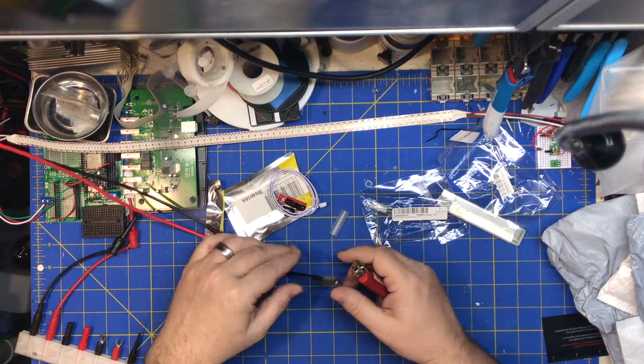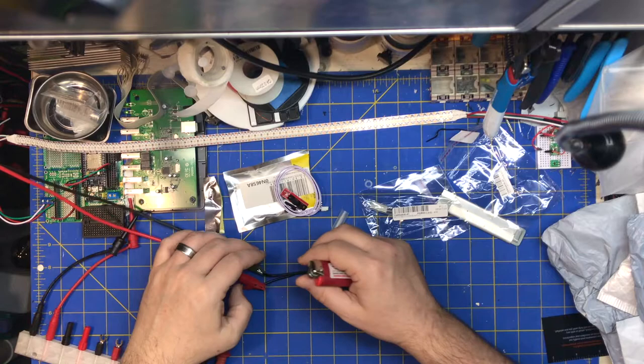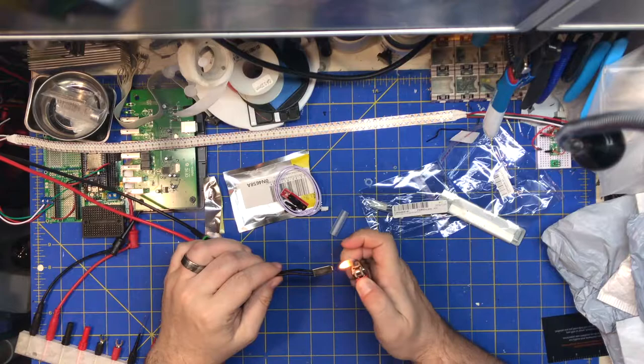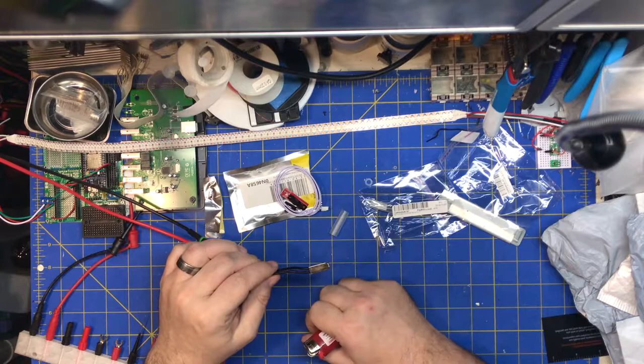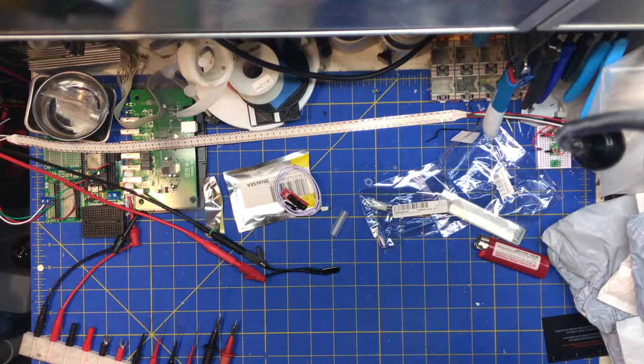Alright, so that's not too high. These take a lot of heat even though they're rated at that — they're made for long soak time because they are bi-metal, so the metal's gotta heat up on the outside and then... there you go. It's not too bad. So this would be good for something that gets extremely hot — you can switch on a fan or something. Let's see how cleanly it shuts off. Pretty cleanly. Cool.